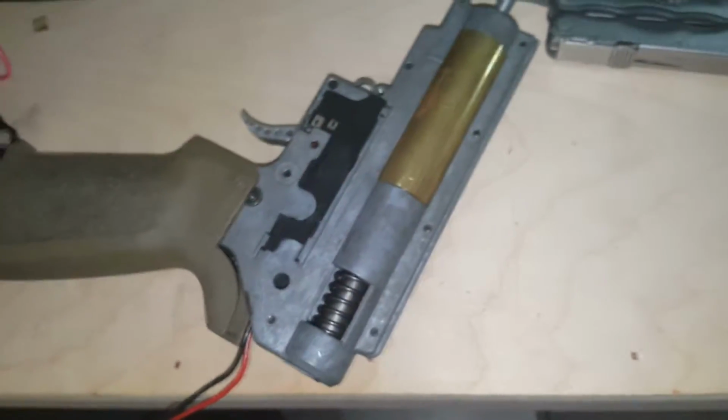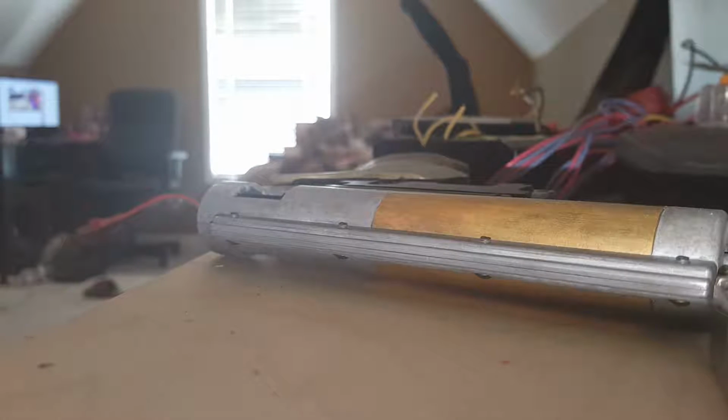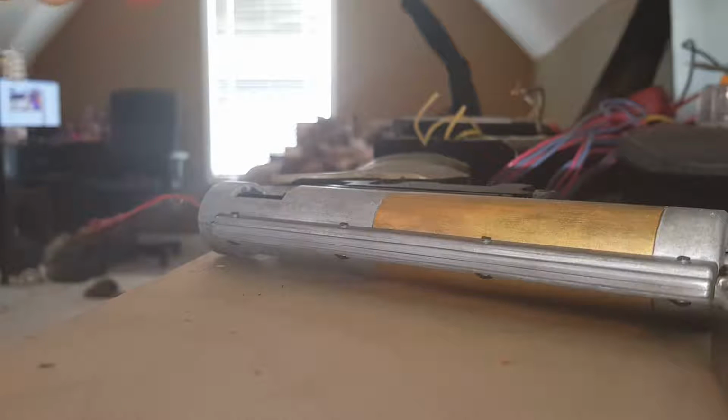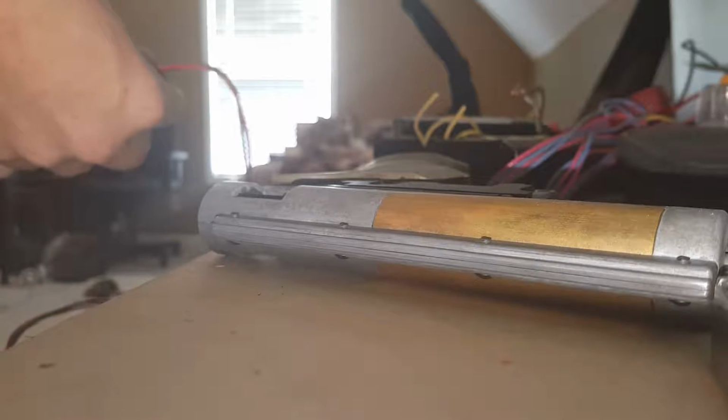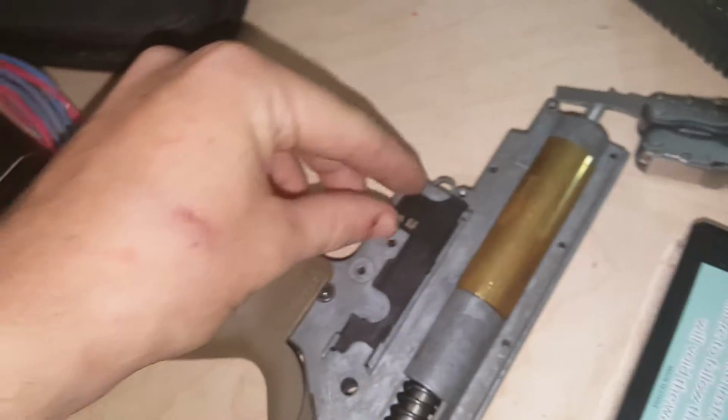And what proves my point that this doesn't work when it's under load is that the motor did perfectly fine when it was just pulling back the tappet plate. But the second the piston stripped, when it was trying to pull back that spring, it was only doing half cycles: a half cycle, 2 full cycles, then repeat a half cycle, and it just keeps repeating that.